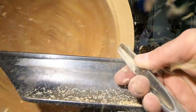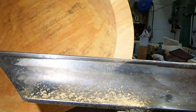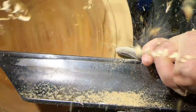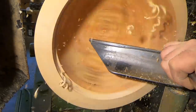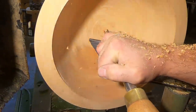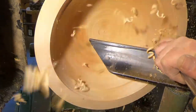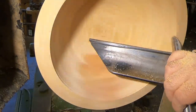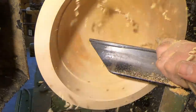Still a little area needs to be turned away. Then, of course, move to the inside. Start the tool on its side. Once you get a shoulder for the bevel to rub against, then you can switch it over with the flutes facing upwards. Just couldn't get that chatter to go away.